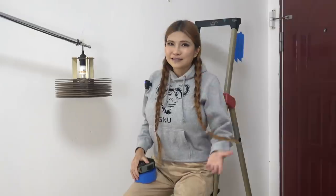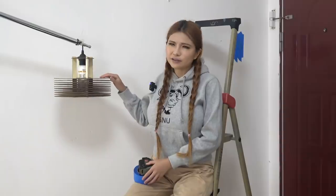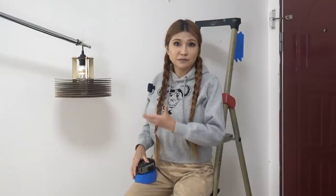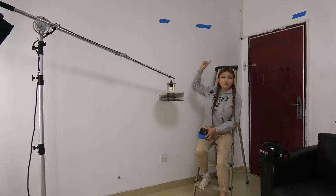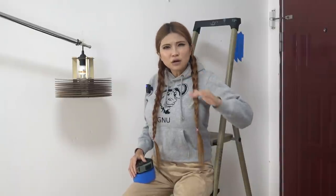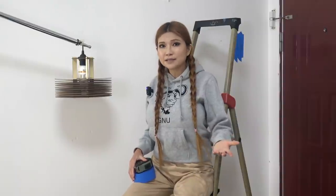Obviously it's intended to hang from a hook or be mounted to an electric box in the ceiling. First off, this UVGI fixture is designed for very small rooms — you can't use a bunch of them in a large room. That's because the light leaves the fixture at about a 4 degree angle, so if you get far enough away from it, that UV will shine right in your eyes. The lowest the UV is allowed is 2.1 meters, so I put pieces of tape on the walls to mark that point. If the ceiling is too low or the fixture is too far from the wall, the angled ultraviolet light will hit below that point, which is not okay — that means it might hit people.